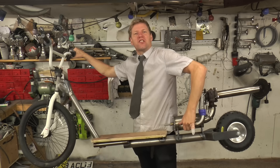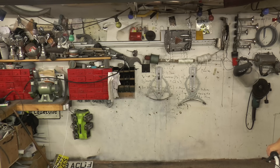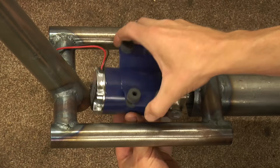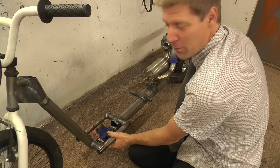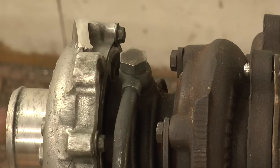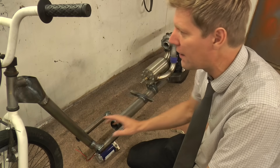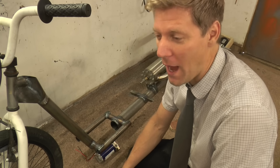Hello again. Right, let's get this jet scooter finished. My oil system — I've got a 12-volt sump drain pump here. Hope that's going to do the job. We're going to shove that in this little gap I've made for it. One side goes into this bit of tube, because for those who haven't seen the first video, this is going to be the oil reservoir — it's not just the frame. The other side, the positive side, is going to go into the turbo. I need to know what the pressure is at all times and be able to bleed it off if it gets over-pressurized. So we need some sort of bypass system, and probably a pressure gauge on the handlebars so I can see what it's doing — and that will look pretty cool.